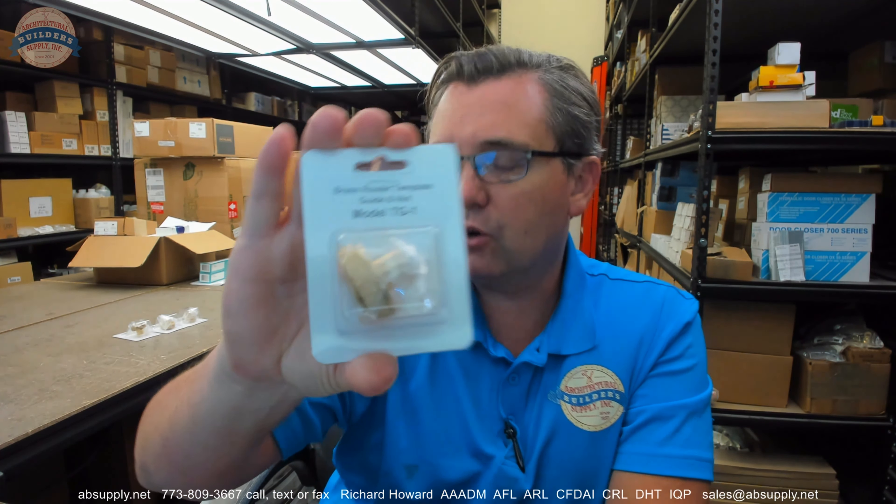In conclusion, if you are going to do any routing on doors and frames, you are going to need all of the equipment. This guide is part and parcel of all of it. When ordering the material initially, think of the template, the guide, and the router bit all together, so you don't end up with just part of it like I did. Luckily my prep was too small and not too large — that was because my guide was too large. The diameter of the guide was too large for what I was working on, which is why the prep was small all the way around. I took it off the door, said it looks great but a little small, discovered the issue pretty quickly, and found the right guide at a specialized woodworking shop nearby.